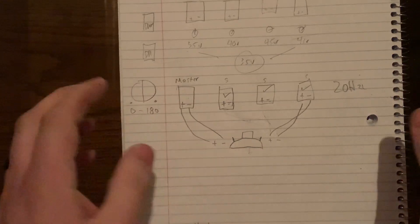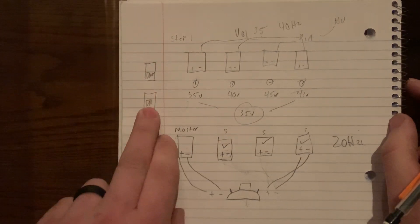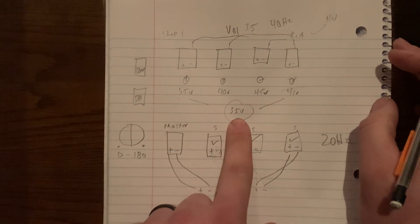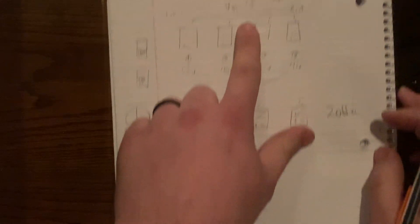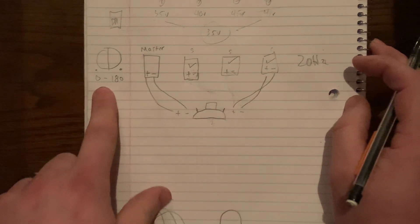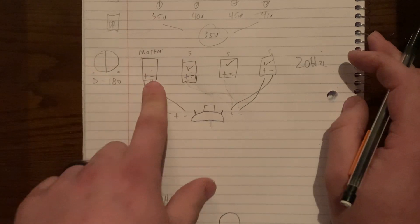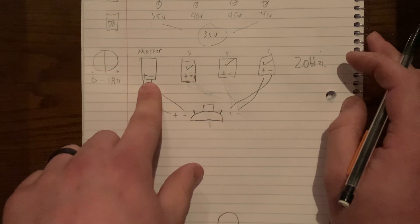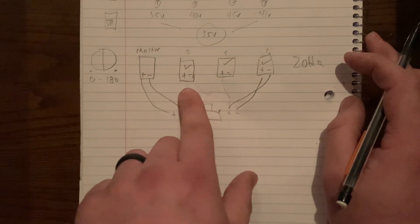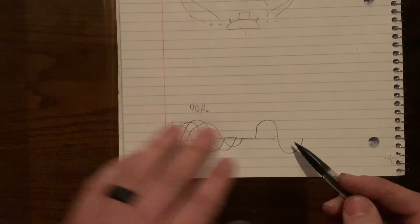Here's the step-by-step recap: Step one — use the DD1 on each amp at volume 35 and 40 Hz, set each gain to just below clipping. Step two — use the DMM to check output voltage, adjust all gains down to match the lowest reading. Step three — switch to 20 Hz at low volume, set all phase knobs to half, pick a master amp, then reverse-polarity connect each slave amp to the test sub and adjust phase until the cone stops moving.